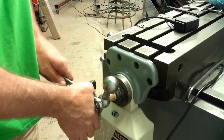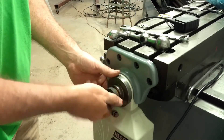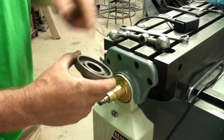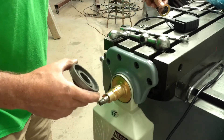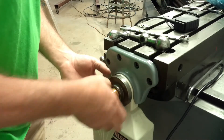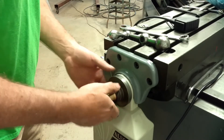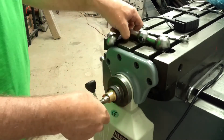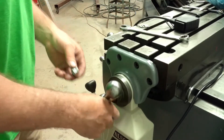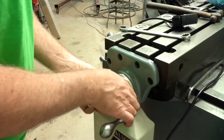And that's bound up — it's binding here. I'm going to put a shim on the back side of the graduated dial and see if that helps. The handle turns free now. You can adjust the knob free.